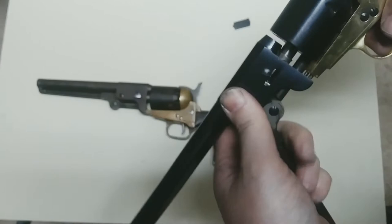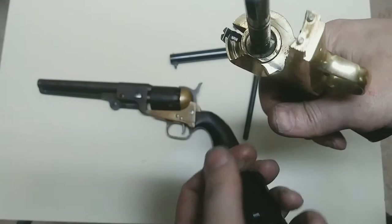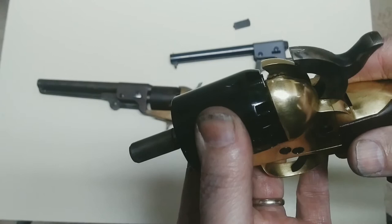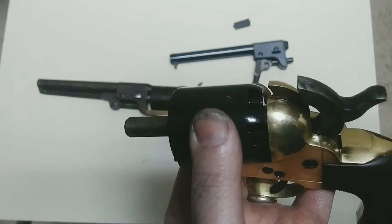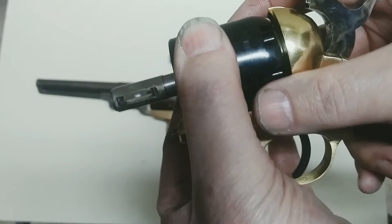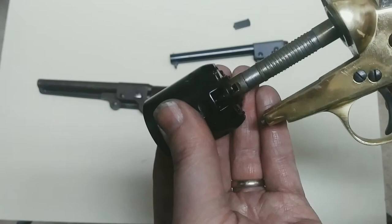Doesn't take much. So what is actually happening: you see the back of the cylinder where the gear teeth are — the gear teeth are digging into this area down here. And when they get shot, they'll always be in the same position. So the gear will be in one exact position — boom — all that pressure backwards slams it into the back of that brass and actually indents it a little bit, and that is actually compressing the metal back. Usually with a brass frame gun when you cock it, you'll notice that the cylinder would actually go forward and then back, forward and then back. That is actually what's happening. The frame is not stretching — it is the gears pounding on the inside here causing that to be a problem. And as a matter of fact, this is what I had to do to the Griswold and Gunnison.